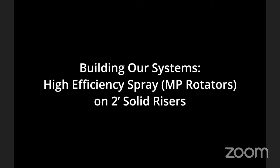So, question from Mark, who had to step away during the break. Can you mix drip and sprinklers in the same sprinkler zone? No, you cannot. You can physically connect the pipes, but you never want to, because the rate that they put out water is going to be different. So when it comes to deciding how long to run your system for, it's not going to be well matched. What you want is one valve would run drip, one valve would run spray if you need to.